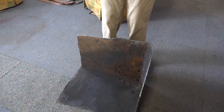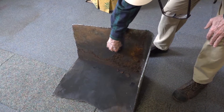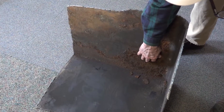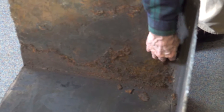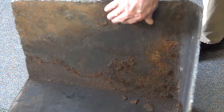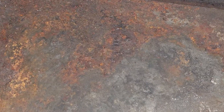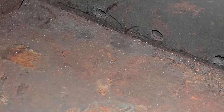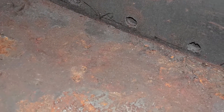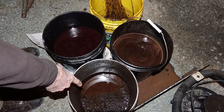If you look at the tank, you'll see that on the inside there's a material that's moved over to this edge and it's contributing to the deterioration. And this material is the steel scaling that's occurring as a result of heavy pitting inside the tank. The pitting comes from an accumulation of sludge at the bottom of the tank.